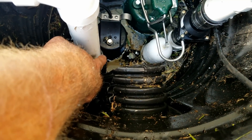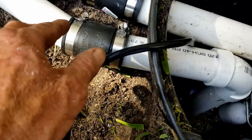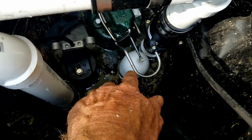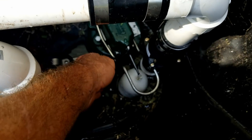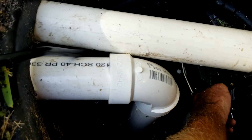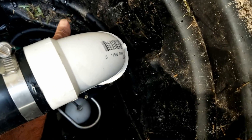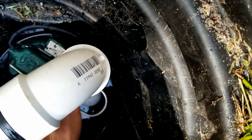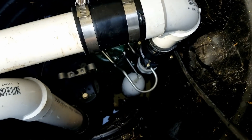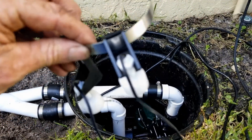The PumpSpy battery backup pump is installed down here — it comes up through here, there's a check valve at the beginning of the pump, rises up, then we use their adapter — a goofy-looking offset Y — but they're nice and secure using a couple of no-hubs. We've got our new Zoller M98 ready and I'm kicking it on to see how well it works. Beautiful — no leaks at all, looks really good. The water you saw spray out is from the little pressure relief hole I drilled, and that's supposed to happen so it doesn't get air-locked.